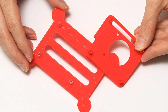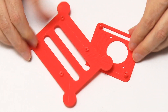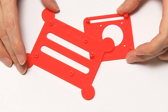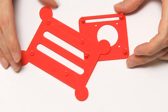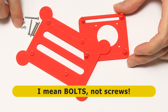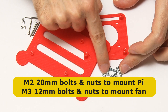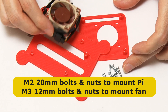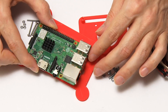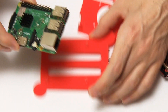I'm very impressed — these look like the parts I designed. In addition to having the parts, we'll need a few extra bits to make this work as a final product. I always think one of the best things about 3D printing is combining it with other types of parts. To make this Raspberry Pi mount we're also going to need some screws: I've got some M2 screws — 20mm M2 screws to mount the Pi through these holes — and some M3 screws, about 12mm, to mount the fan. And of course we've got the fan itself and the Raspberry Pi with a little heatsink.